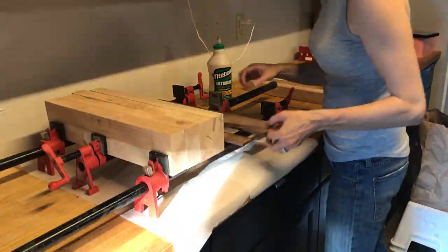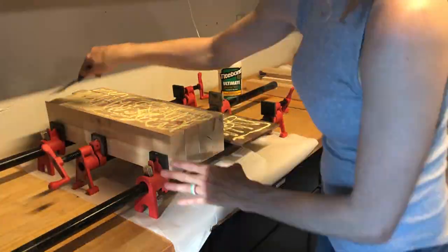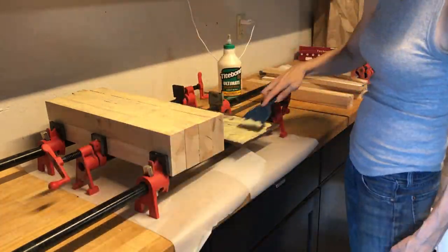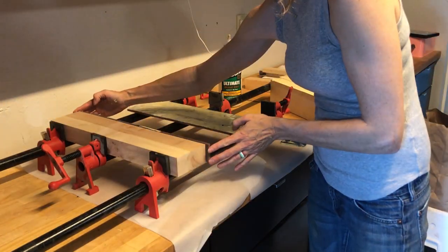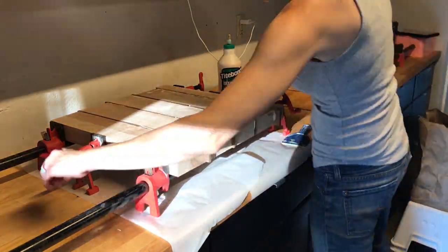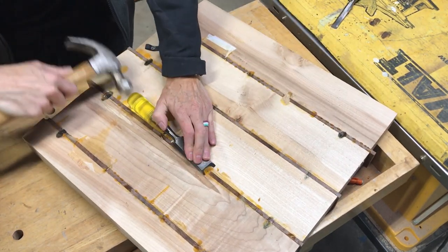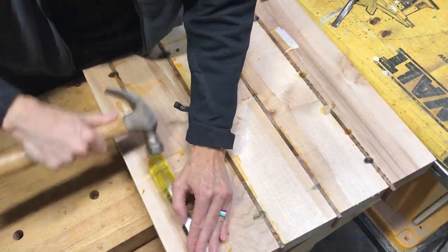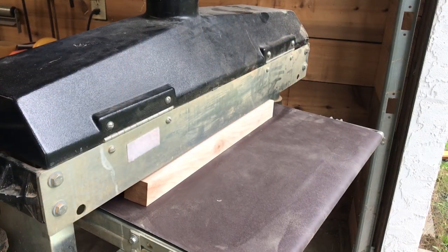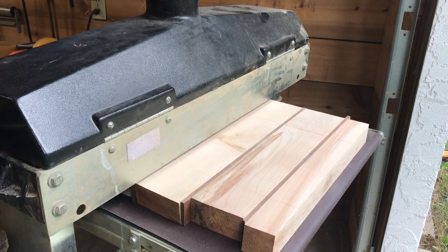My glue-up is the same as you see me do time and time again. My glue choice seems to be a hot topic, so I'll just say I use a waterproof food-safe glue that I like — feel free to use whatever you want. I really like these pipe clamps because they elevate my board, letting it dry on the bottom and top while also keeping it completely flat. Using a chisel, I remove the dry glue, removing enough to get a smooth surface so it will lie flat on the drum sander. I flattened out both sides with the sander. This can also be done with an orbital sander; however, I do enough sanding projects that I bought this used sander and it has been well worth the money.